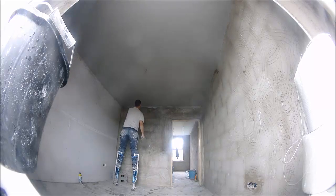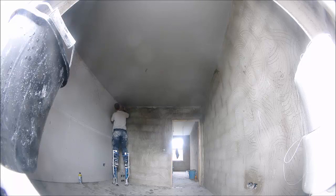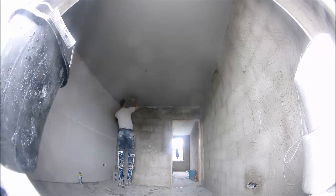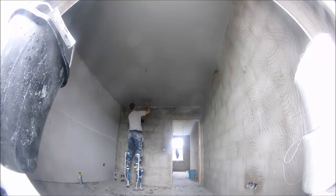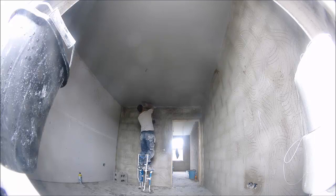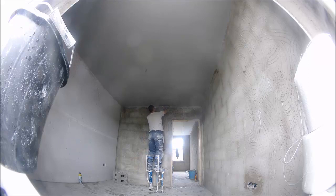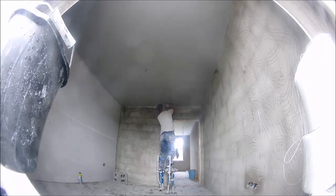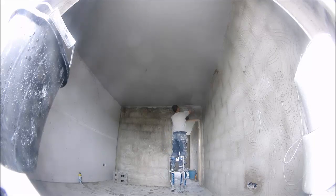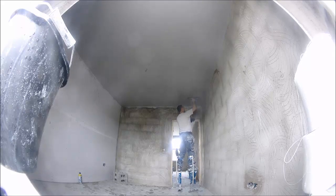This is now the second troweling period — again starting back where you started. At this stage you will definitely need water. The particular plaster I use sets in about an hour and fifteen minutes, so I can trowel this ceiling, trowel the other one, and come straight back. I'm on my feet and troweling non-stop for maybe two hours depending on how many ceilings I have on. You're pulling out the back angle again but this time there will be water and you open your trowel at a sharper angle so the blade cuts a slight bit more. Wet it down to lubricate so the trowel doesn't tear the finish.